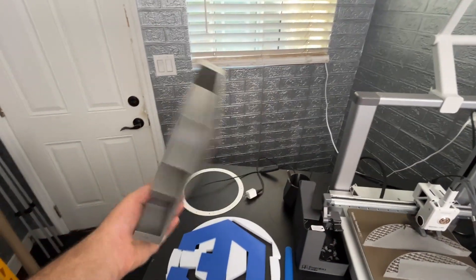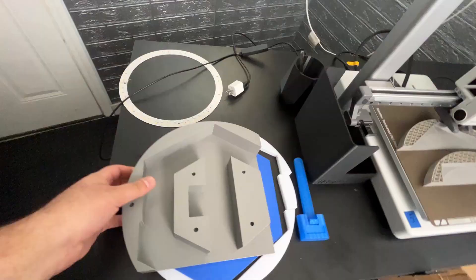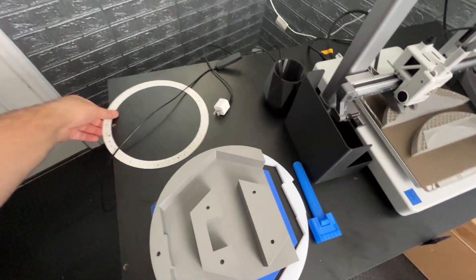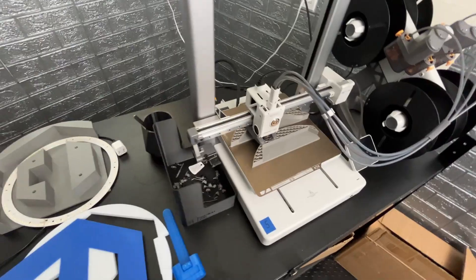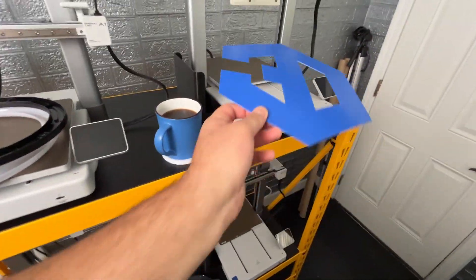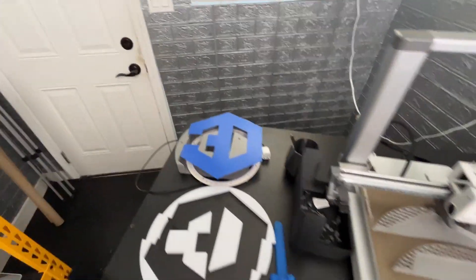For that reason I needed to create some depth — this is definitely not deep enough for that light to sit in and illuminate properly. So what I'm doing here is printing it out with some old PETG. I use gray PETG to print those production parts, and this is that same PETG — some of it is three or four months old, just sitting out of the bag with no desiccants, and it still printed out fantastic. This light is going to sit in here, and I've got the other pieces printing out because it was too large for the 256mm build plate of the Bambu Lab A1. The pieces are going to sit on top and illuminate it. None of this stuff could fit on the build plate properly, so I had to cut the bottom and the top and then epoxy-welded it — hopefully from afar it just looks solid.